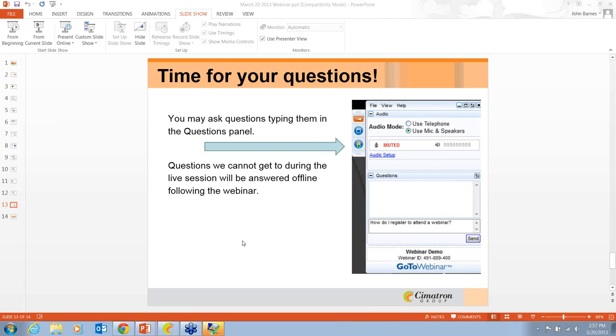Yes. Actually, with Moldex 3D, we use everything as a 3D mesh, including the runner, cavity, and cooling channel. And we generate solid mesh with only one click. So basically, if you have your CAD geometry, then you could generate solid mesh easily. Why do I emphasize 3D mesh is very important? When the material goes through the runner, it will cause friction. Friction will cause heat, and heat will cause a temperature difference. When the temperature is hotter, the viscosity will be lower, which means your material will be easier to flow. And warpage is a combination of flow, pack, and cool. So if you are not able to predict your flow pattern correctly, then your warpage won't be correct, especially when the material includes fiber.